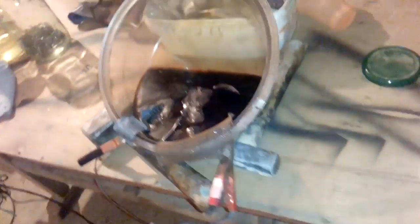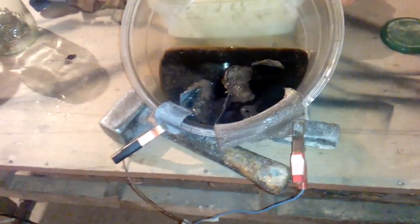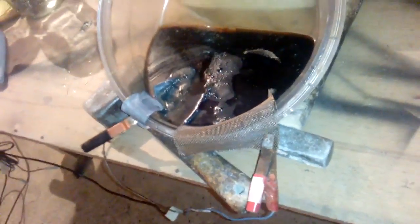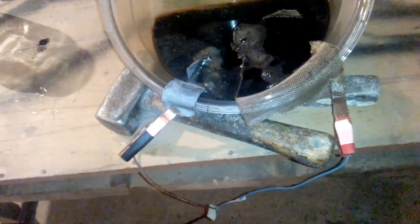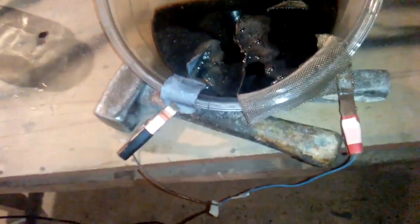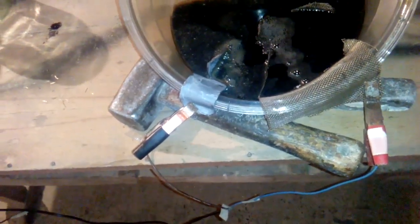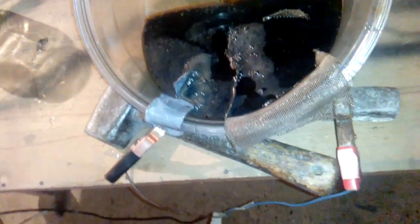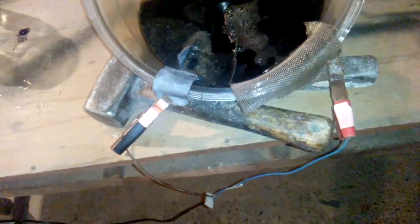One important thing: never play with water near the sulfuric acid. Because water in sulfuric acid is not a good friend. If just one drop of water splashes in this dish the reaction is pretty bad. At the end you could put acid into water — in the reverse way. Because water in the acid, never. Acid in the water, yes. But little and slowly.